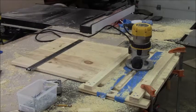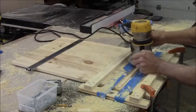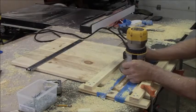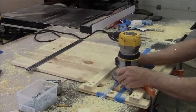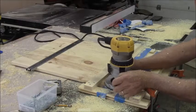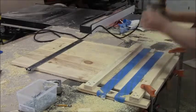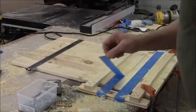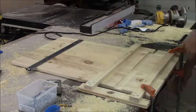Now we have the recessed slides. I've been around this perimeter of it, and I'm just nibbling away at it because the router likes to run away like a madman when it digs in. I'm just walking back and forth. This one is popping the edge of the track. I'm heading up to 10 inches. You can see how I clamped it down, I put the tape on — I didn't get any chip-out. Just a few shop tips here and progress on the routing of the grooves.